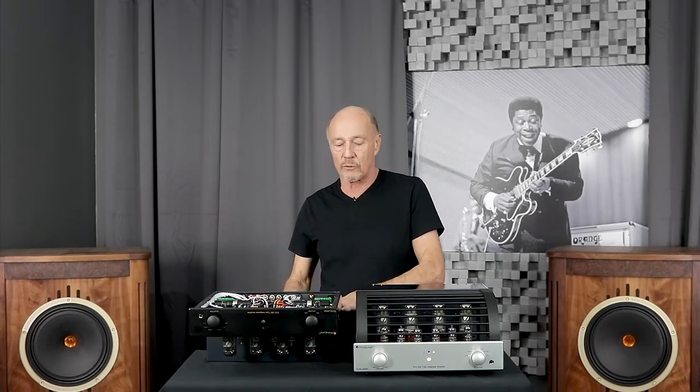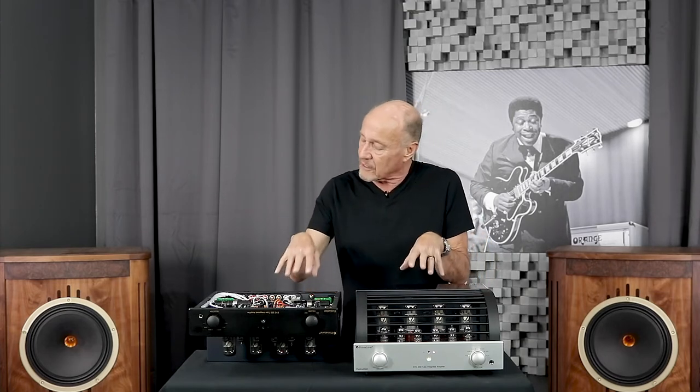The headphone circuit — the outgoing model did not have a headphone amp. Headphones are speakers, just little speakers. In so many products that have a headphone jack the way they achieve it is with a little op-amp — you can do it for two bucks and it'll sound fine. But what Prima Luna did was different. The controller board opens and closes relays in the back. When you flip a switch on the side, the signal is diverted from the speaker taps — the relay closes and sends the signal to a voltage-divider network that lowers the power to an appropriate level for earphones. Now you've got a world-class headphone amp. If you've never heard a tube headphone amp, it's something that is really, really amazing. It could turn you into a fan, and people buy these and never even hook up speakers.